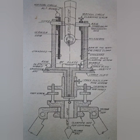The lower parallel plate has a central aperture through which a plumb bob may be suspended. The upper parallel plate, or tribrach, is supported by means of four or three leveling screws by which the instrument may be leveled. In modern instruments, the shifting head is provided to center the instrument quickly and accurately. It consists of two plates movable relatively to each other and to the tripod head. By this arrangement, the whole instrument can be rotated through a small horizontal distance relatively to the tripod. I shall describe it thoroughly next day.